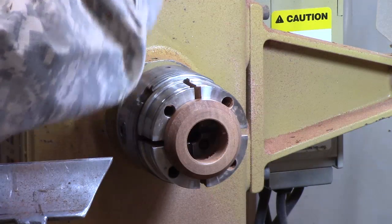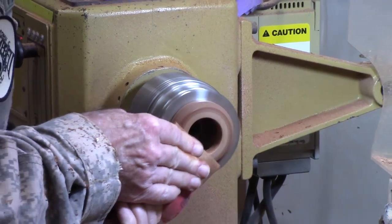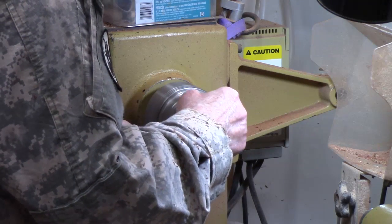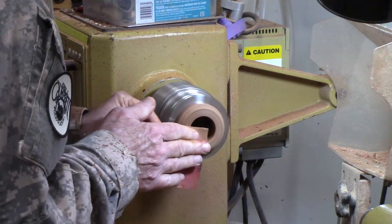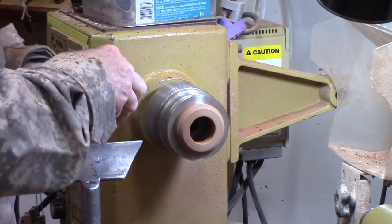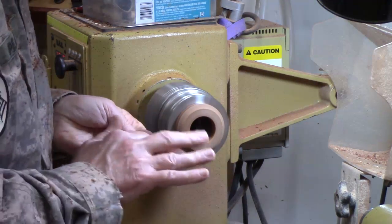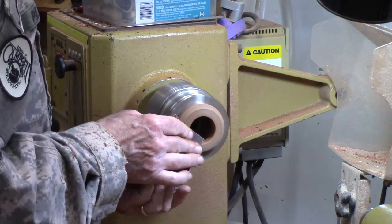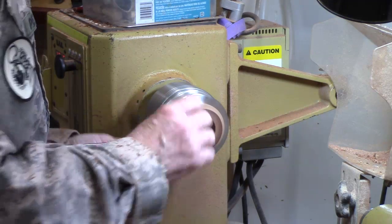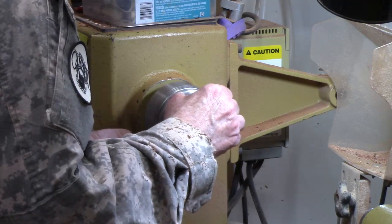Alright. I'll touch this quickly with 120 grit, but really too coarse. There really aren't many tool marks. And 180 grit. And let's put a little bit of sanding butter on here to keep the dust down. I'll put that on the sandpaper. And that'll keep the dangerous dust down to a minimum, and also keeps it cooler. With exotics, that prevents checking.